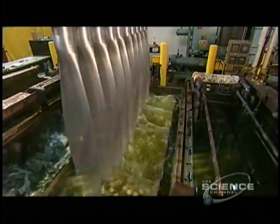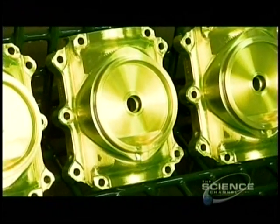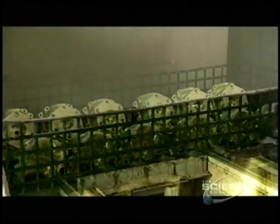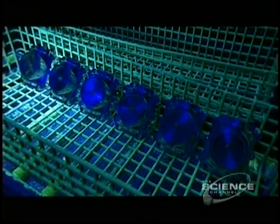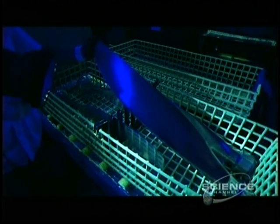The factory tests all critical parts for surface defects by dipping them in a fluorescent solution that leaches into any imperfections. After rinsing, an inspection under black light reveals the results: a blue glow means the parts are okay, while imperfections show up as bright fluorescent green. Defective parts are either repaired or rejected from the production line.